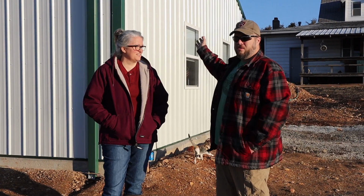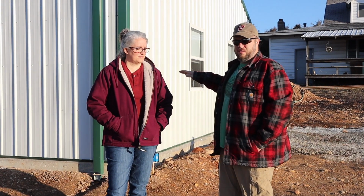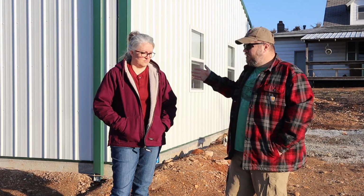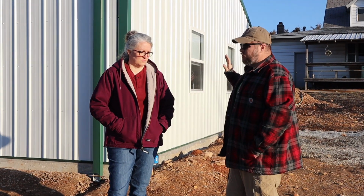Underneath the roof panels, we did put an insulation down over top of the joists and over top of the purlins, and then laid our metal down on top of it to allow us to have that open space inside. We did not put insulation underneath the walls on the outside. The wall cavities are all filled with insulation though from the inside, like you would build a standard exterior wall.